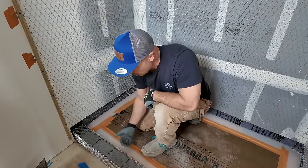That's because the moisture is wicking up and over and getting down to the 2x4s on the other side. So this is basically a capillary stop right here. I'm going to fill it in with sealant once we're done. But that detail is actually spelled out in B441, and I'll try to highlight that for you so you can see where it's at. A lot of Northern California one coat floaters are not aware of this detail. So anyways, take it for what it is.